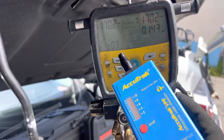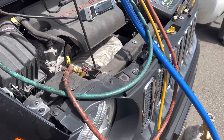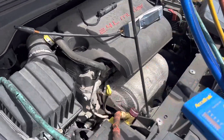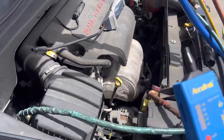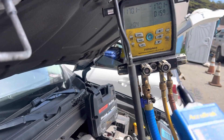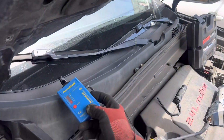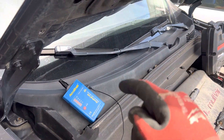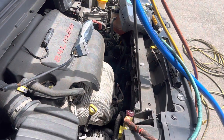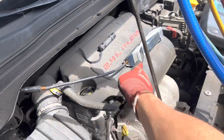Three tenths. So we'll let this sit a while, and I'm going to prep and get ready to run this system with refrigerant in it to look for a leak. I did this really quickly to try to find a fast obvious leak, and I'll keep searching. But I can't hold the camera and do this at the same time. If I find it with this there'll be a second video, otherwise the next video will be me pulling a vacuum, filling it up with refrigerant, and going around with the refrigerant leak detector.